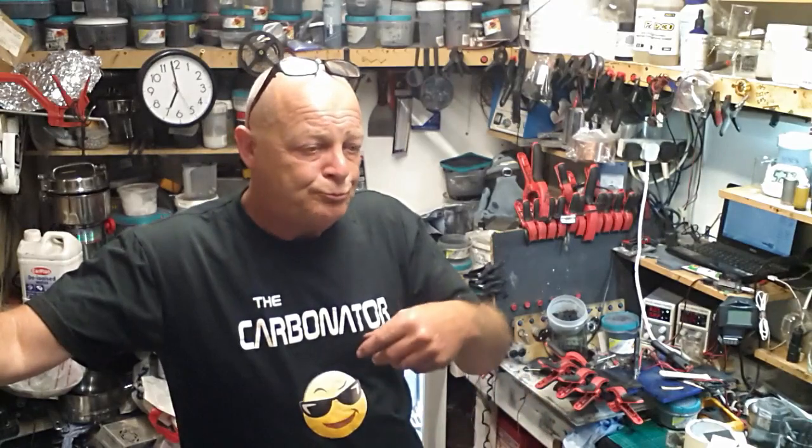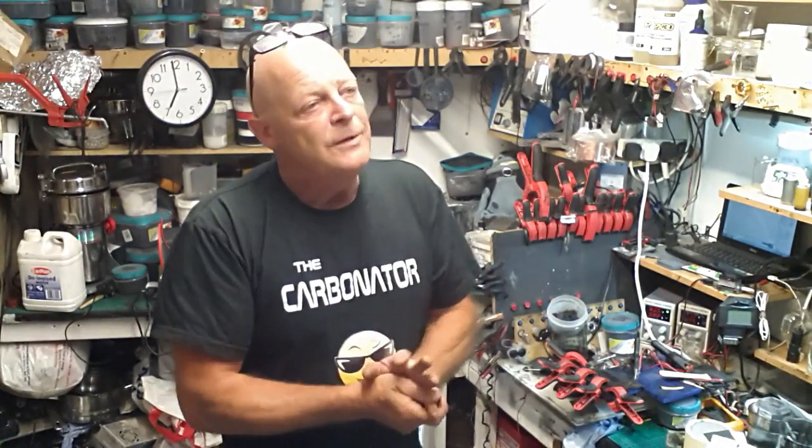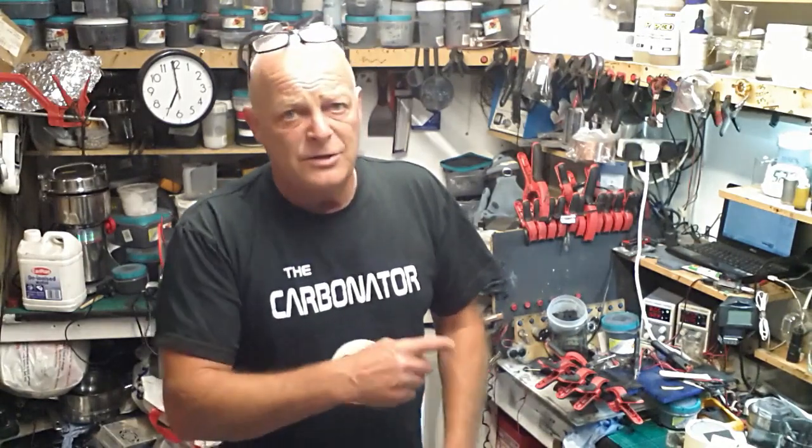Except, on a personal level, I like to build the battery, charge it for a minute, 2 minutes at the most, put it under load, just to balance it all out and get all the ions moving to where they want to be, you know. So that's what I do, and then I do my 15 minute charge after that. So yeah, it's working well. We've got to standardise what we're doing, so that's just what we are doing. So there you go, a little bit more, won't bore you anymore now. Let's get some results if we can.